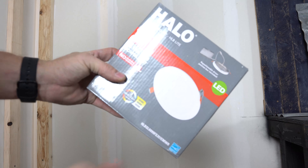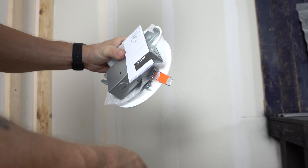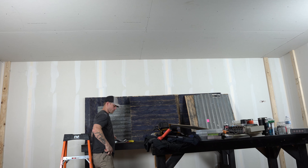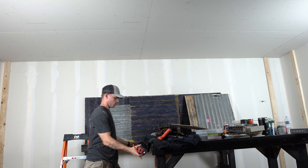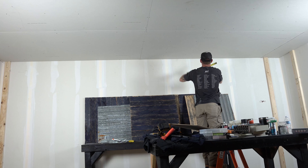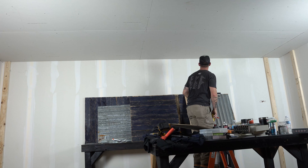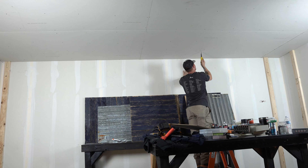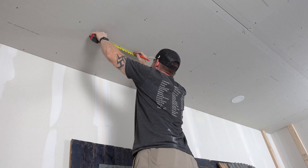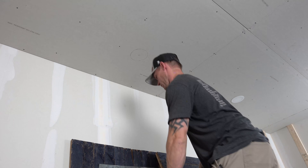I got two cans put in because I need some backlighting behind my head, kind of down on me — it helps with the silhouette. I've been studying film people on YouTube and you're evidently supposed to have some light behind your head. So from underneath I cut six-inch holes. A lot of these pop-in trims don't actually have a little paper cut-out disc to trace, so I just measured the can — it ended up being six and an eighth — traced around that and used a sheetrock saw to cut the hole out.